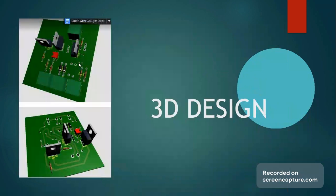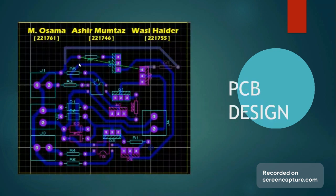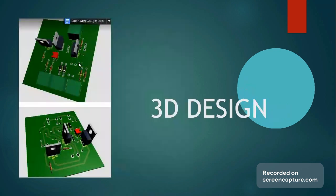Ahead of that, we have our 3D design. This especially came in handy because when we started off, we had our breadboard testing, and when we verified that all the components were working and the configuration was functional, we then moved on to PCBs after the chemical process, after the drilling. This is what helped us place our components accurately, and this also helped us determine whether the components would fit on the given design. Because when we design the PCB, of course, all the components are in place, but when it comes to 3D, there is an amount of space that each component takes up, and so the 3D design helps us determine if there are any areas where components might clash or take up each other's space, etc. And so this was crucial in that process.